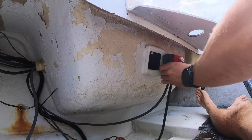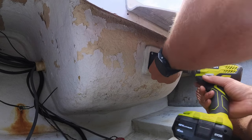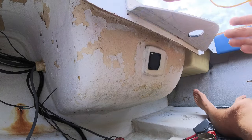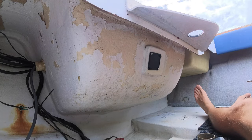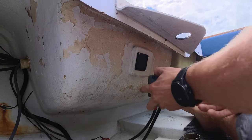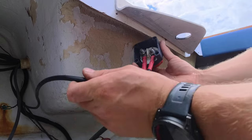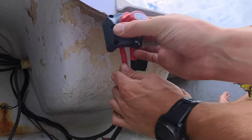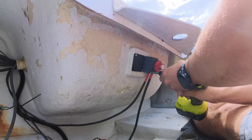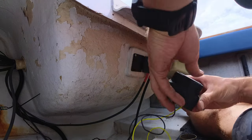Just going to triple-check that's still going to fit — yeah, that'll go next to it. Then the other locking screw in the opposite corner. I'm going to put this other isolator switch up next to it so it's out of the way. This is one I already had on my boat. It's fairly simple — both positives come in: one from the battery and one to the motor, and it's just simply an on/off. That's on there nice and solid, still functions, and the new one fits next to it nicely.